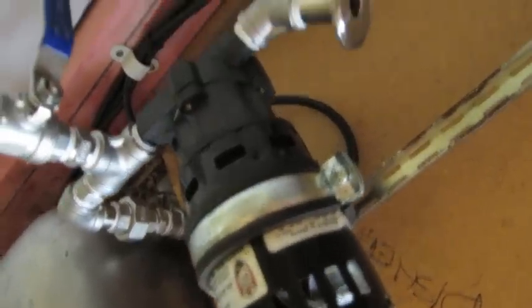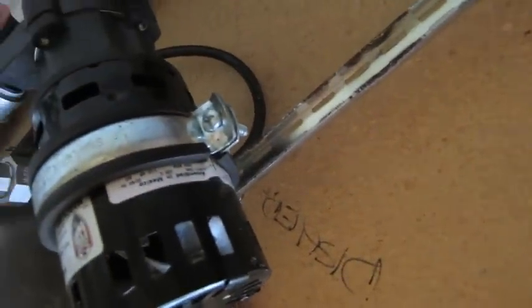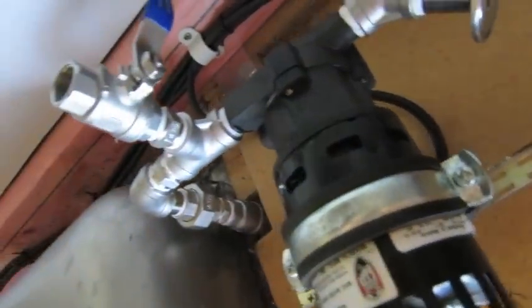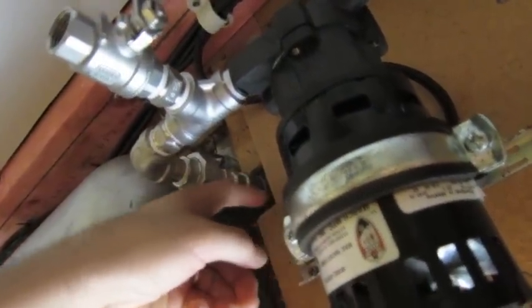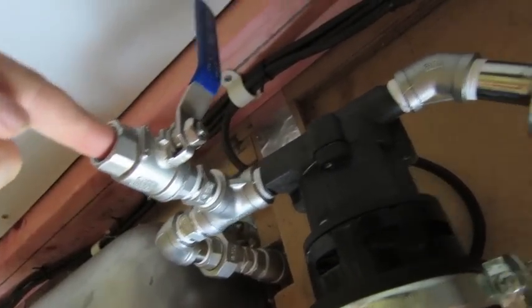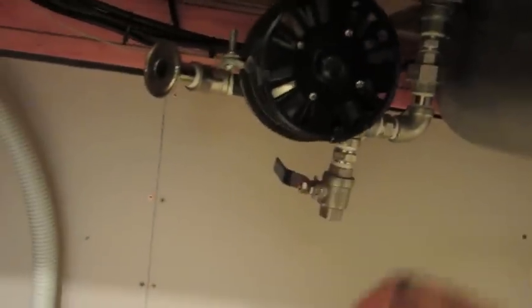So, they're all tidied, going in their respective holes, and the other thing I've done is, I've got the pump in place. Now the bracket is just a temporary bracket at the moment, so that I could hold it in place and make sure I had it the right height, and then I'll make a better bracket for it. But drilled a hole through the bench and that goes into the triclover. Got a union joint here so I can unscrew it and take the whole thing away. And I've got a tap at the lowest point so I can drain everything. And the inlet is a triclover coming into the pump. Still needs to be squared up a little bit. It's just sort of temporarily mounted in there. Just need to square up the pipes a tad.